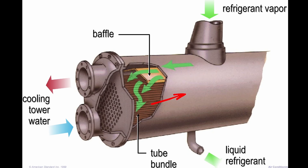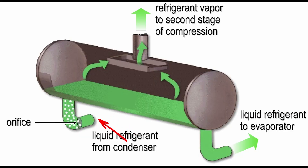The point of this condenser is to allow the condensing gas to fully saturate down into a fully liquid state and drain out as needed. There will be a saturation sensor in the liquid line — that is how the chiller is able to determine its saturation temperature, because this refrigerant leaving is going to be at a saturated temp. That liquid line from the condenser flows into this first stage orifice plate. This is just a fixed bore metering device — think of it as just a plate with a whole bunch of holes in it — and that refrigerant flows through here into our economizer.